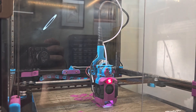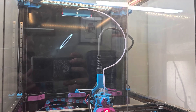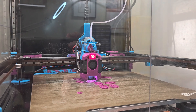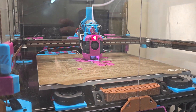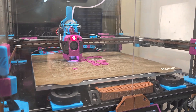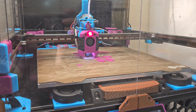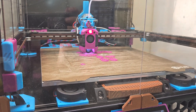I'll be working on that in the next few days and will post an update once those panels are in. After getting the umbilical wiring a bit more solid than it was before, I'm quite happy with the results. I'm printing a few more parts before doing another mod — the next thing I'm planning to modify is adding kinematic bed mounts from 3D Lab Tech for the 2.4, which I've already received.